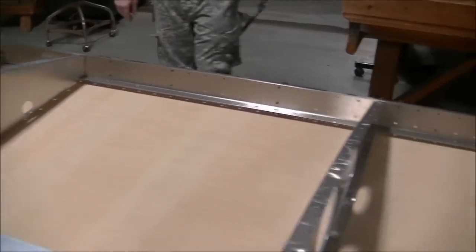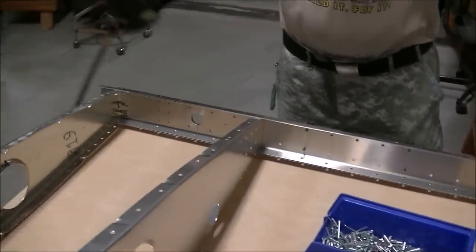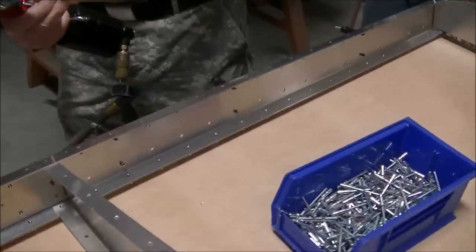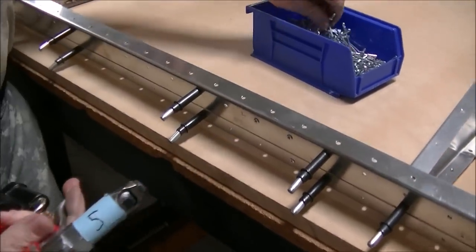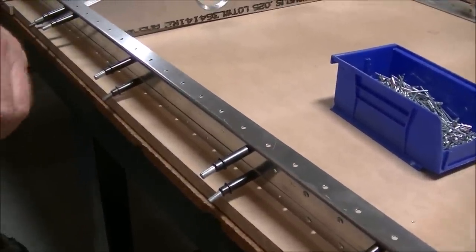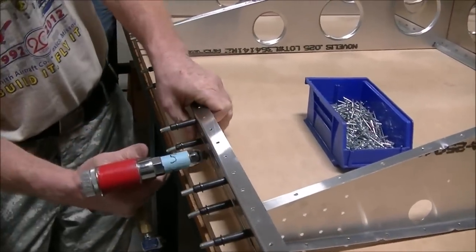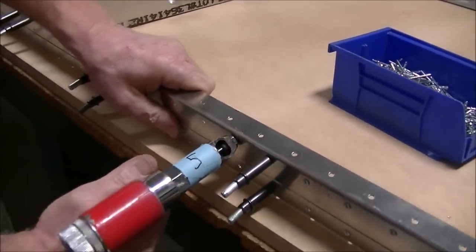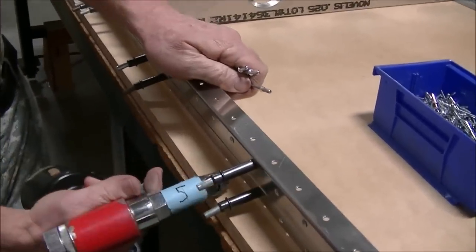After clecoing the section together we're ready to start riveting. Steve is set up with the pneumatic rivet puller hooked up to the airline — these are pretty much all A5 rivets in the 5/32nd holes. There's no race to get this done quickly, but you can see why it's called a pop rivet — it's just one set and it just pops; really nothing to it. A couple things to pay attention to: be square on the part, nice and perpendicular, apply a little bit of pressure so the rivet is seated nicely in the hole.